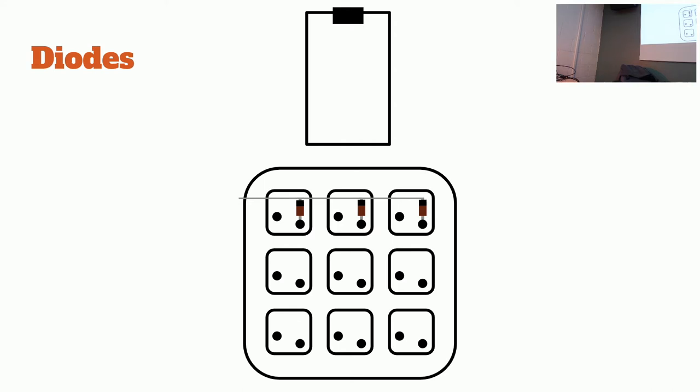Looks like you're good. So once you have the loop soldered, you can go ahead and trim off the excess diode leg. On the loop side. Don't trim the other side, the black side. Remember, we don't have any desoldering. We don't have any solder suckers. So if you need to desolder anything, you're gonna have to do it with your mouth. Actually, my or your fingers.